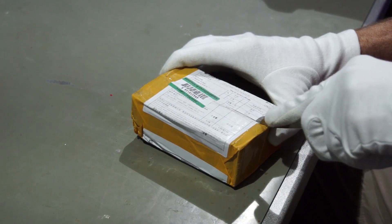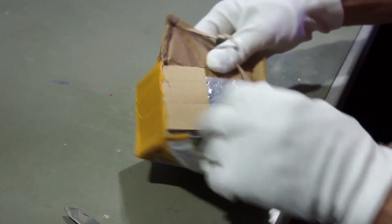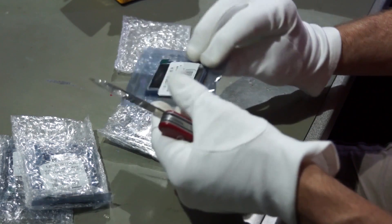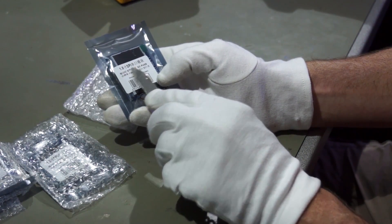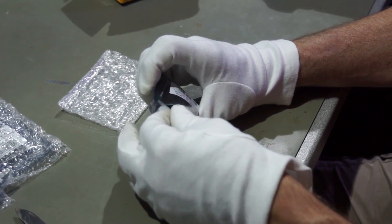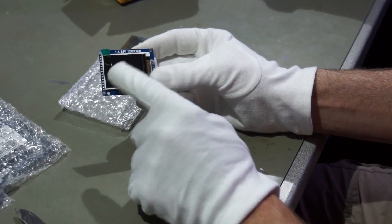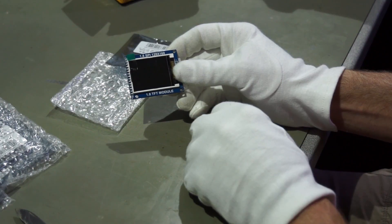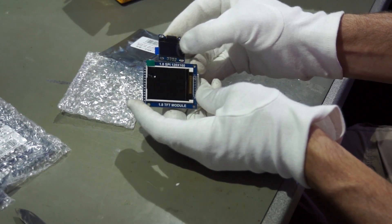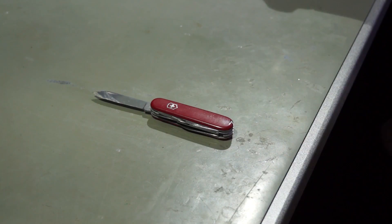Well packaged — not easy to open, even not with a Swiss Army knife. It's a 1.8 inch display with an SPI connection. I do not particularly like the SPI connection; I like more the I2C connection. But displays need a certain speed, and this is why SPI is probably not bad here. They are a little bit bigger than the other OLED displays. Because my view is getting worse, I hope I will see it a little better. If you compare the display size, it is quite a big difference, however the resolution is similar, so the letters and numbers should be bigger.